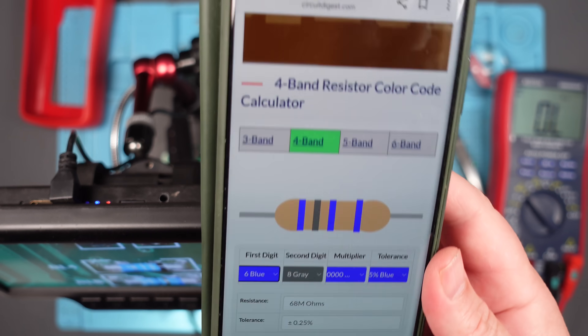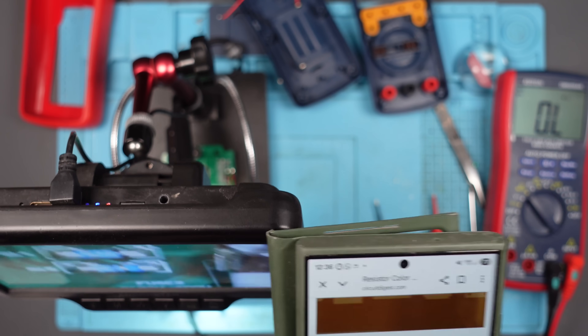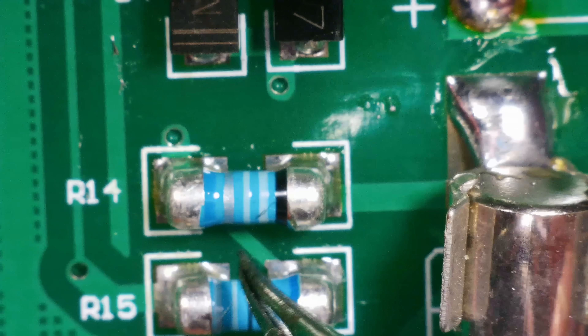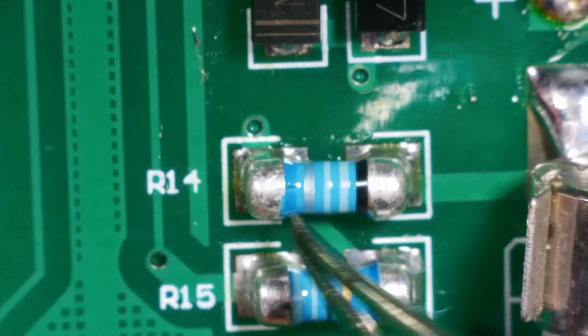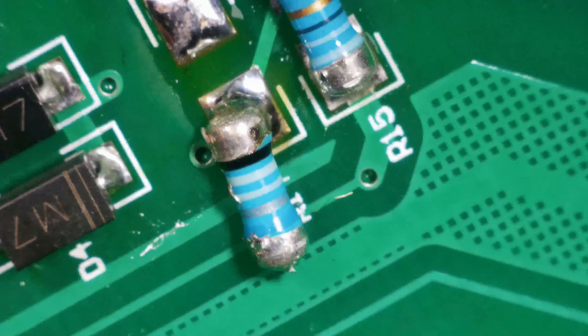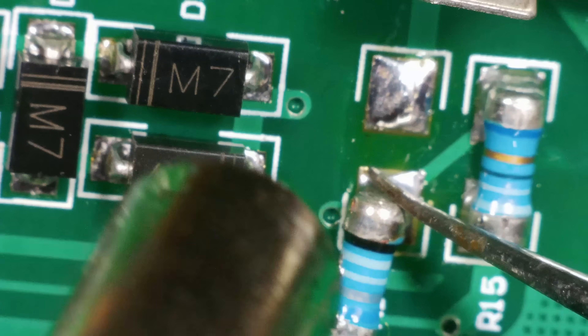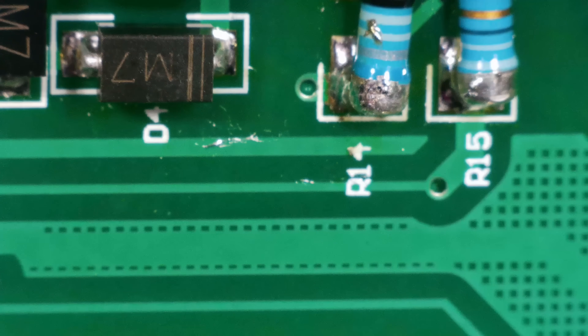Let's skip to the bit where it's under the microscope. I'm trying to use this colour band calculator, but this resistor has definitely got a black stripe on it, and no matter what I do — whether I do four or five band — black isn't an option for either end of it. So how am I supposed to know what that is? I could be doing it wrong, more than likely am. I'm going to measure the resistance on it. I get 1.8 ohms. I Googled it and apparently it's a 1 ohm resistor. So I'm just going to put it back.